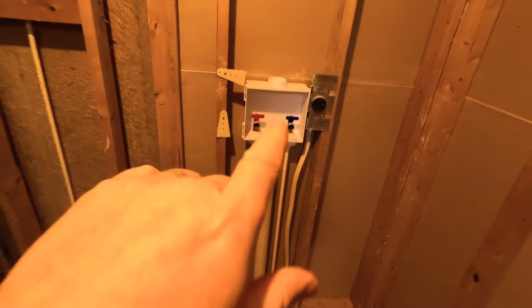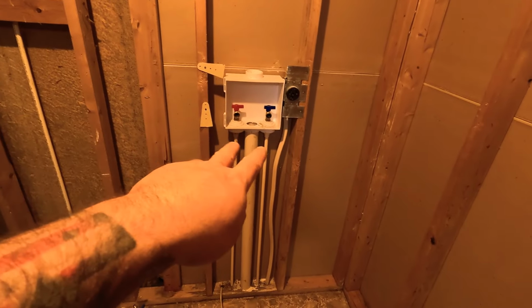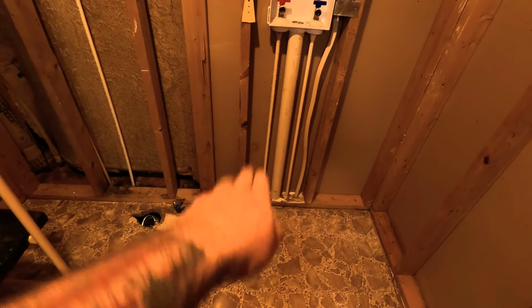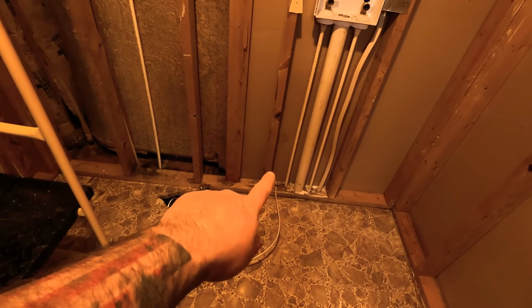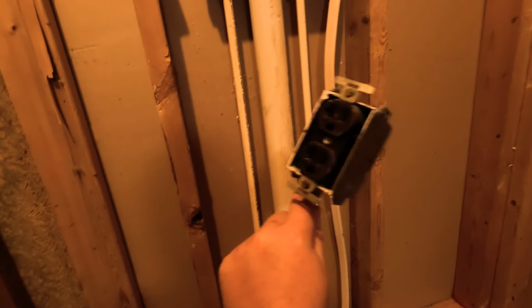Alright guys, I'm tired, it's been a long day. I'll run and get the sheetrock tomorrow. We can sheetrock most of it, honestly. We can get this out of here. Just turn the breaker off, take that plug, push it down through the floor, and then just cut that crap out. We'll seal that off. I got a 2x4 put over it. That plug, I just move it right over or put it on the wall. I don't know how they had it. It just fell right out of the wall. It wasn't even nailed to the stud or nothing.